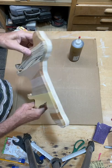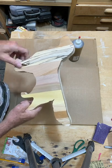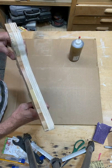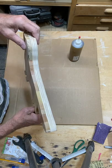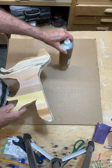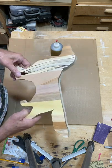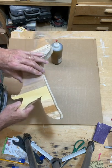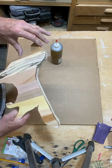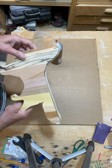Here's the almost-finished retriever, routed out real nice. Didn't quite get the wavy hair right here on the chest, but the tail turned out really good. Down here on the legs it's a little bit wavy, but it turned out pretty good overall. The thickness of the backer board is probably more than I would like, but overall it turned out really nice. So what I'm going to do is coat it with some walnut oil, let that soak in for about a day, and then I'll come back with a special polyurethane that has UV protectors in it. It's a fast-drying water-based polyurethane, and you can put three, four, or five coats on here — it really preserves the color of the wood for a long period of time, especially if it's in a lighted area.